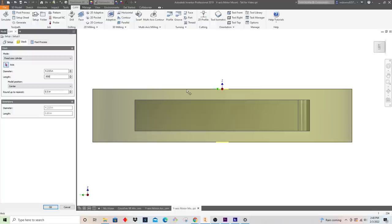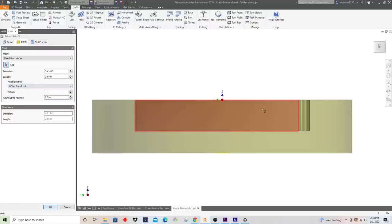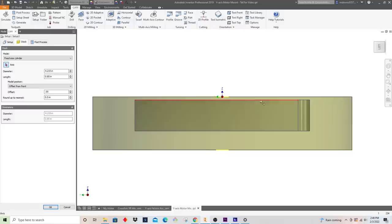If you remember out at the vise, I wanted to make it so that the tracks that I machined into this puck, as it sits in the vise, were flat. That's why I put that 1, 2, 3 block in when I flipped it over. So I'm going to offset it from the top here, and we can go kind of generous, something like a 50 thousandths cleanup off the top. I do think that will all clean up, and I guess we'll find out here soon.